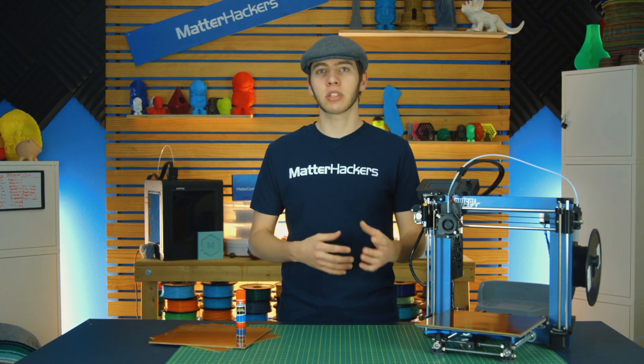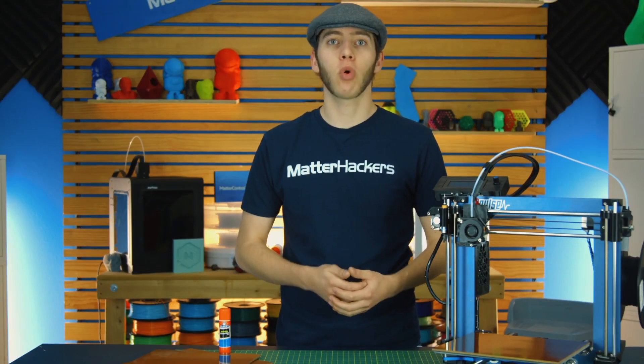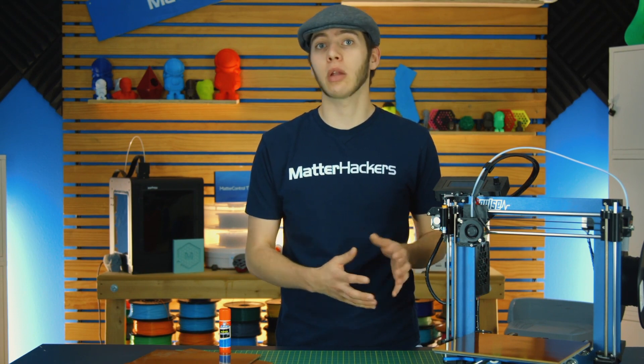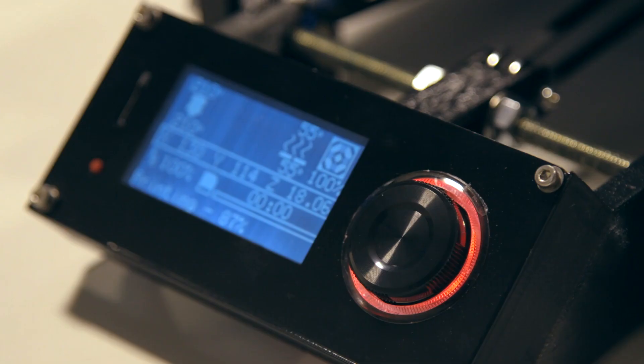But there are some steps you will want to take, and little tips and tricks here and there that make printing on Garolite work a lot better. So let's dive into those. First off, while printing with PETG or nylon on Garolite without heat can work pretty well, it doesn't hurt to have a heated bed, just like with PLA. A heated bed will just further ensure that your parts actually stick.